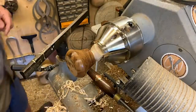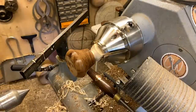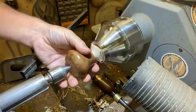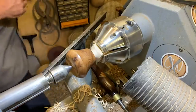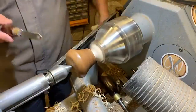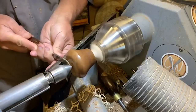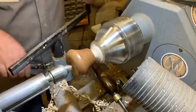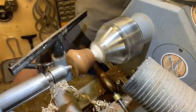There's our little drive center and a single-pointed tailstock center. I'll put my light back on. Just going to clean up that nib — I'm going to use the side scrape with the parting tool, which we talked about last time. Quite a useful little technique. Speed to zero, turn the machine on. A rough sanding first — 100 grit — then off with the dust extractor for a moment.